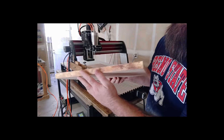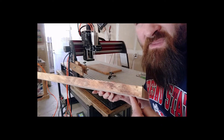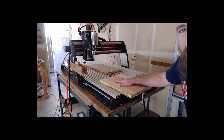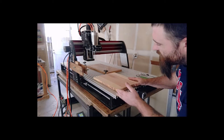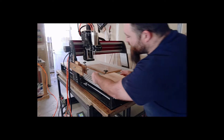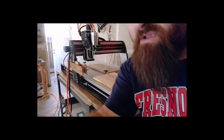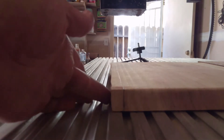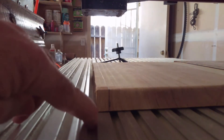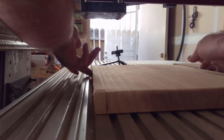It's live edge, so it's really hard to square it up. A lot of times what I'll do is just square the edge of the material up with the edges of the table — that gives me a straight line. I put my material down and square it up using the groove in this table, then clamp it down.